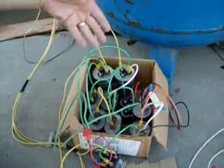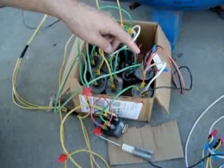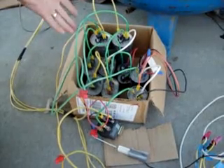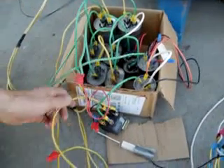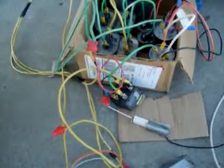So you've got about six, and in the start capacitors here we have two of them connected in series because it's high voltage, and they're about $6 each. So maybe you have $30 or $40 worth of capacitors here. We have a couple of resistors to bleed off the charge, and we have our potential relay right here. This starts the motor and disconnects the capacitor automatically.